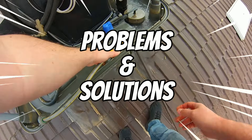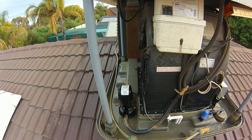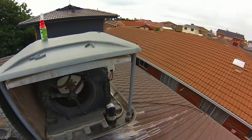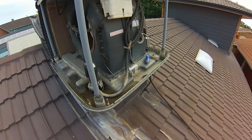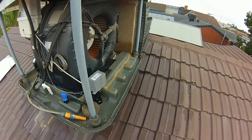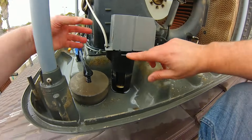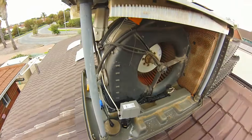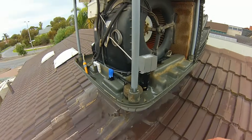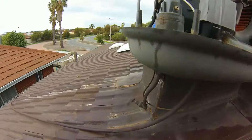Let's go into some troubleshooting — I'll put links in the description for more technical aspects. One common fault is the Tornado water pump: these can rattle loose from their mounts, so make sure they're solid and that there's no debris in the filter below. They may last five to ten years before burning out. The drain valves — which fit Breeze Air, Braemar, or Seeley units — have caused no end of trouble. They fail easily due to an internal motor, limit switches, and a gasket seal that hardens. If the valve doesn't reach its limit, the evaporative cooler will just shut down as a safety feature to stop wasting water.